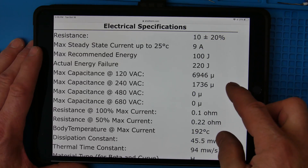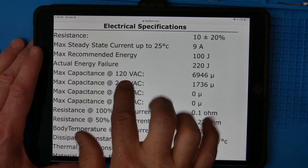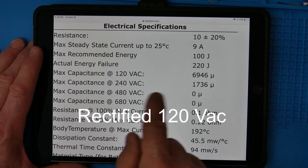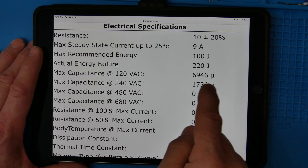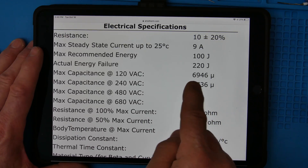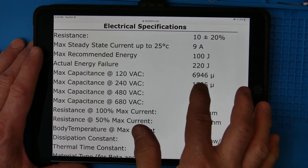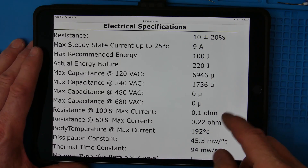Basically, just quickly as a reminder: this capacitor is sitting on 120 volts. But if you're going through a transformer stepping the voltage down — say you step it down to half, like plus or minus 30 volts — then you could essentially go twice the size in capacitance. So in our kind of audio amplifier power supplies, that means you can almost double these values. It's a rough way to look at it, but it's good to do the math.